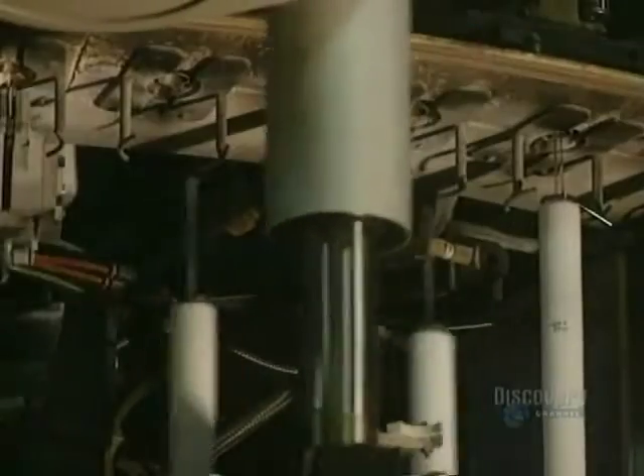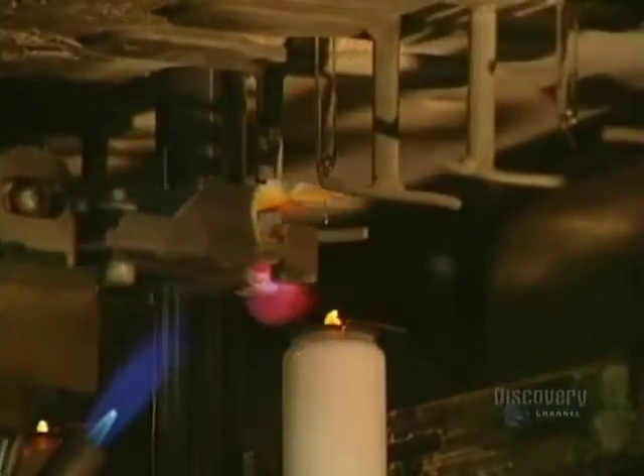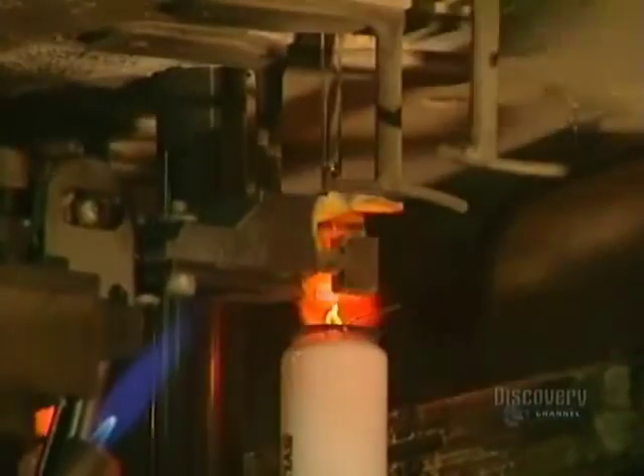One important step remains. This is where the glass tube is emptied of air and filled with gas. This machine also decarbonizes the tube and introduces the drop of mercury, essential for producing light. Once the very tiny drop of mercury is injected into the tube, the production process for making the fluorescent lamp is now nearing completion.